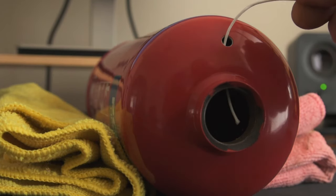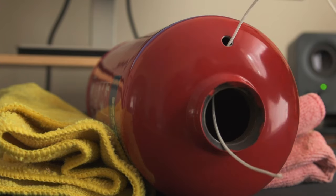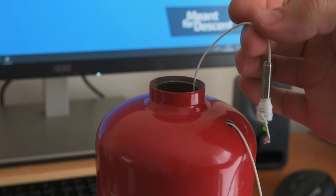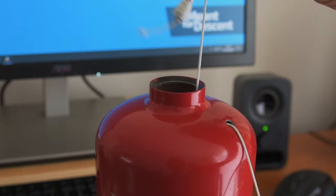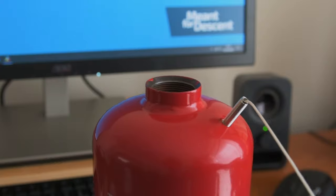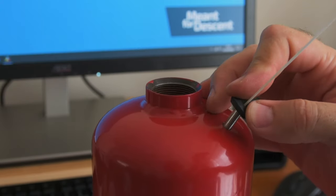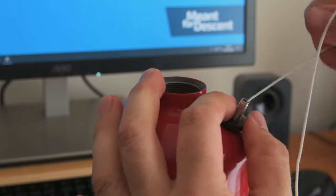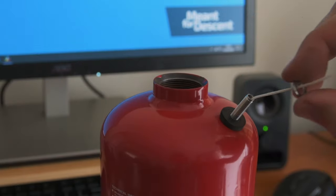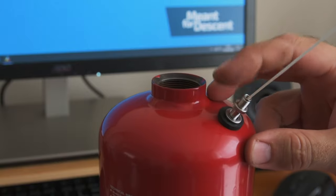Now that there are no sharp edges, I'm going to feed a line through the small hole and let gravity guide it towards the larger one. The line can then be used to pull the valve into place. This bottle is quite different to a wheel rim, so I've wrapped the valve in PTFE tape to prevent air leaking once it's been pressurised. Next, I'm going to fit a rubber washer — I made this one from a 3mm thick rubber offcut — and on top of that, I'm going to fit an M6 washer. Then I'm going to fit the valve's locking ring, so I can create a good, airtight seal.